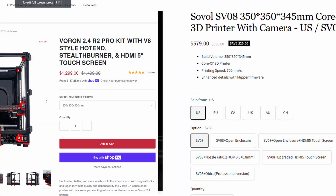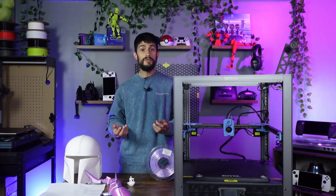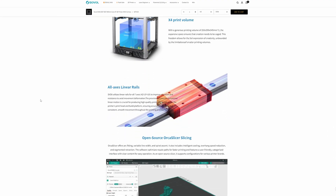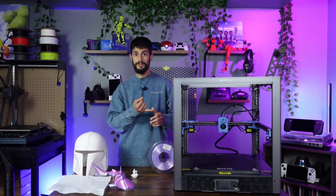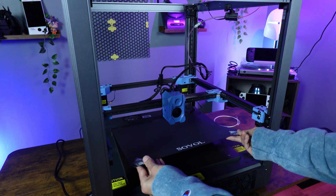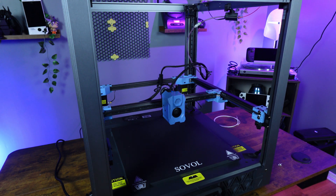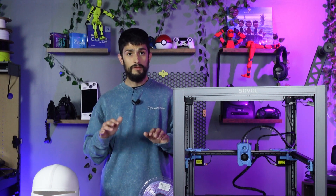My word of advice: do not keep this printer near your bedroom. Now, time for the good and the bad about the SV08. On the good side — you're getting a Voron for nearly half the cost and without the whole build process. It comes loaded with features like adaptive bed mesh, a built-in camera for monitoring and time lapses, the Klipper web interface, an included runout sensor, pressure advance, input shaping, and overall great speed. The included full-metal PEI sheet is standard, but the bed has guides so you always know where to place it. The massive 350x350x345mm build volume is also a plus. It also has quad gantry leveling, so you don't need to worry about the four corners since they're each driven by their own motors. Plus, with built-in dampeners, you don't have to worry about it falling if it loses power suddenly.